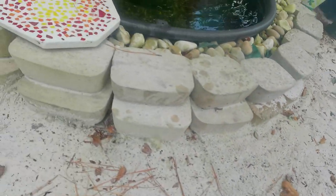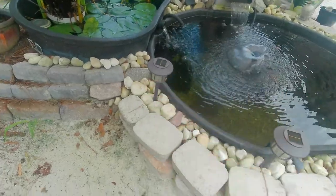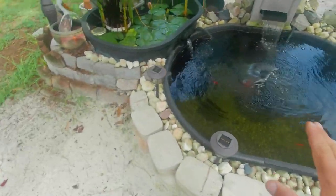So what we're doing today is some proper maintenance — something I've been talking about doing for a while. Let me show you what's going on. When it rains really hard, the water drains out of the pond and it erodes around the pond. What we're going to do today is pull back all of the pavers and all the stones. I have little holes drilled along the rim of the pond so that when the water rises, it drains out all around the pond. I need to divert the water from everywhere to just going right here, and I'm going to put a stone leach field in right here on this side of the pond so the water runs out into the yard and doesn't erode our beach.